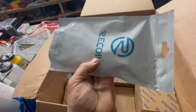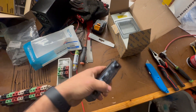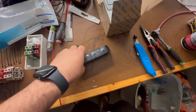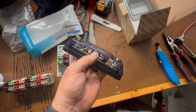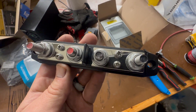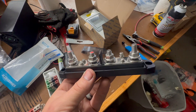Now these are fun — I like these. We use these all the time. It's kind of like a little Swiss army knife bus bar. So what I like about this is you can see it's a bus bar from the fine people at Recoil. It's got a nice little integrated cover. The Lynx Distributor is by far the best bus bar out there, but this is super affordable. It's only good for smaller systems — a Multiplus 2000 would be the biggest I'd ever consider putting on it in a 12 volt system. We've got basically two spots for positives, two for negatives, but you also get these screw-down terminals, and I really like those for doing little things like shunt power. If you're just doing a small system and you don't want to overdo it, this is a great bus bar because it's got your positive and negative together.